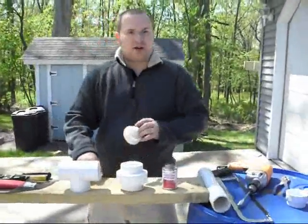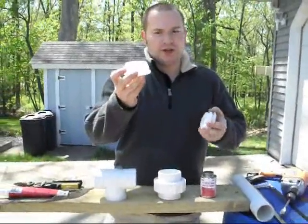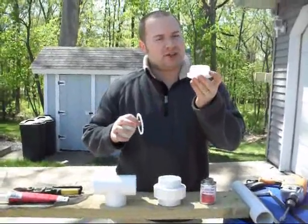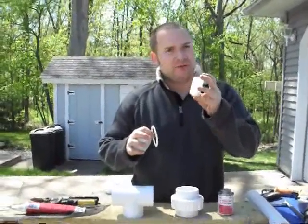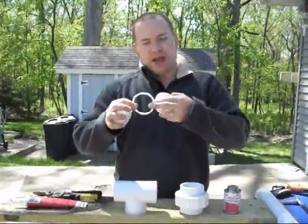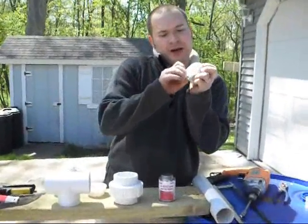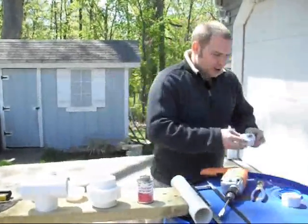One thing I wanted to show you — and I've had a couple comments about this on some of my other videos — is on top of these barrels there is a coarse threaded hole with very coarse threads. This is the one that you want to tighten in and make sure you keep in the barrel. Now this one is a very fine threaded hole, and this is what the 2-inch PVC male thread will be using. It's the very fine part, and that's what went in here. Also on these tops there's another rubber O-ring — it's very important that you use this rubber O-ring on your 2-inch threaded pipe. So you'll put that around there and then you'll just screw it in place.